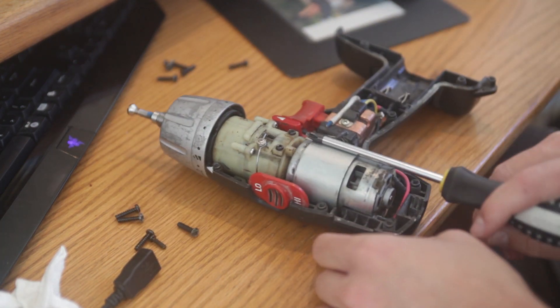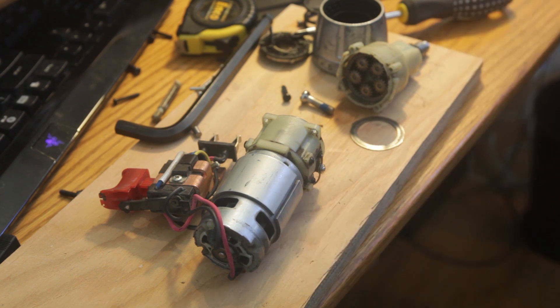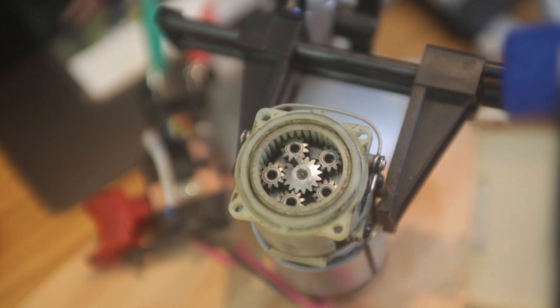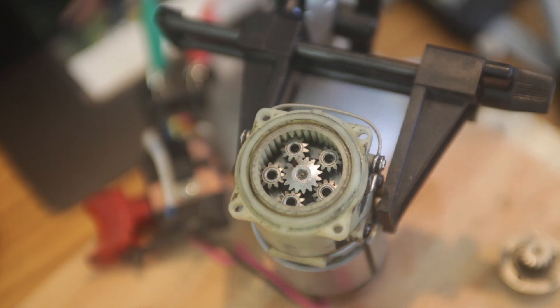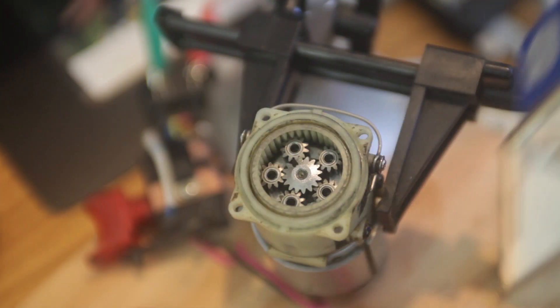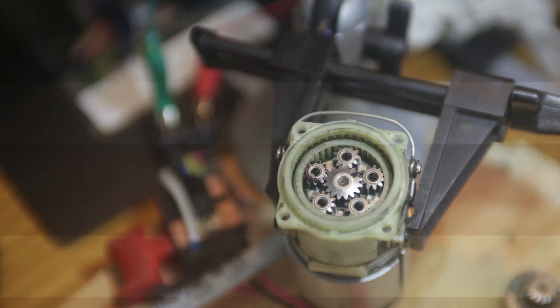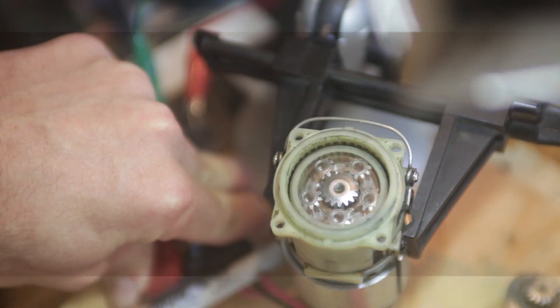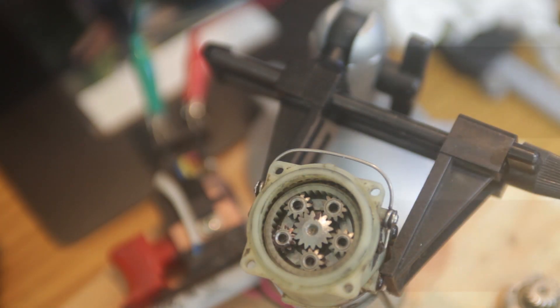This is the actual motor, then you've got the gearbox, and then the clutch. The problem right now is the gearbox is too long — it sticks out the bottom. A decision has been made to remove the top half of the gearbox. I want to get an idea of what the output of this first planetary setup is, and to do that I'm going to use the last project — the stroboscope. I've colored one of the gears with a Sharpie. That is 4800 RPM.